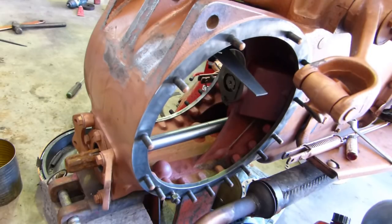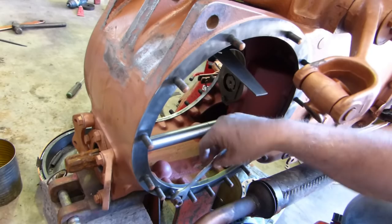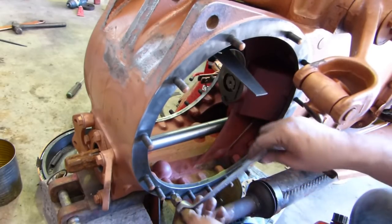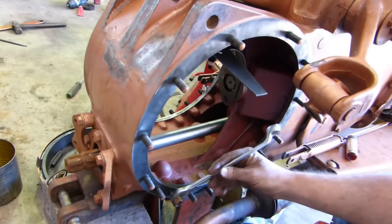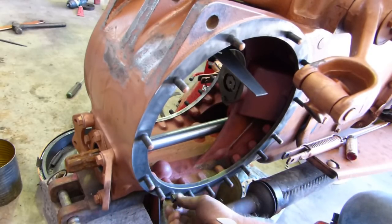By double nut, we just get two nuts and lock them together against each other. That way, with the Loctite on, you can feel that's gone hard because the nuts are turning on the thread now. So we know that nut's gone in as far as it can go. Release the nut, and we know if this ever has to come apart again, that stud will stay where it's supposed to be.